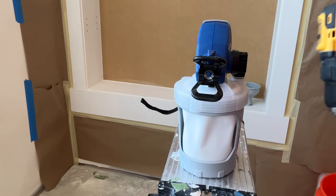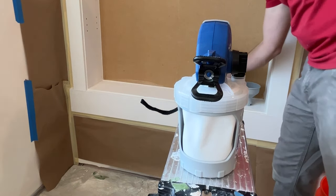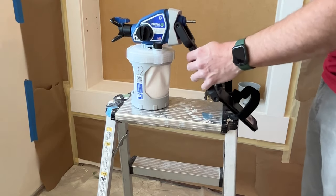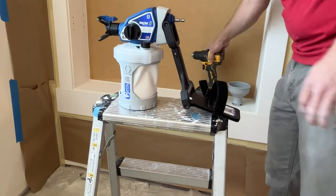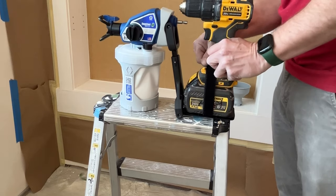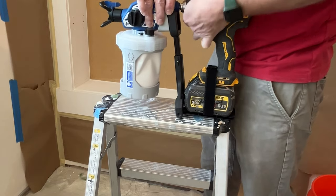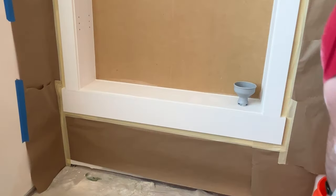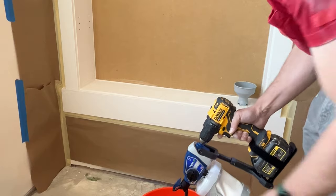Before spraying, I decided to switch to one of the Flex Volt batteries — it's bigger, longer lasting, and much taller than typical batteries, so I wanted to see how the gun handled the size change. I should have done this before attaching the paint cup so it wasn't so front heavy. Adjusting the height is a spring-loaded mechanism — you just pull down and it gets taller, super easy. I chucked it back in the drill carefully so as not to accidentally hit the trigger, set the drill to drill mode, tested the spray into the bucket, and once it looked good, started spraying the wall.